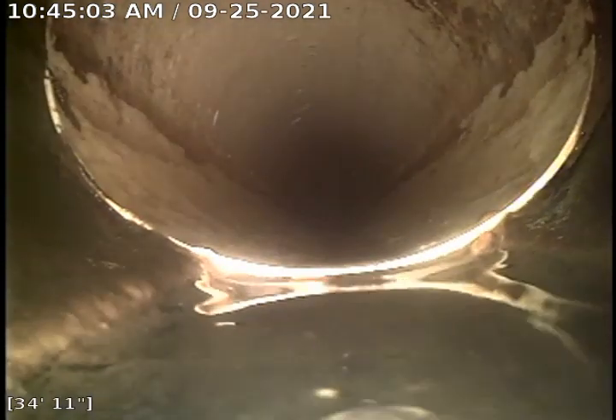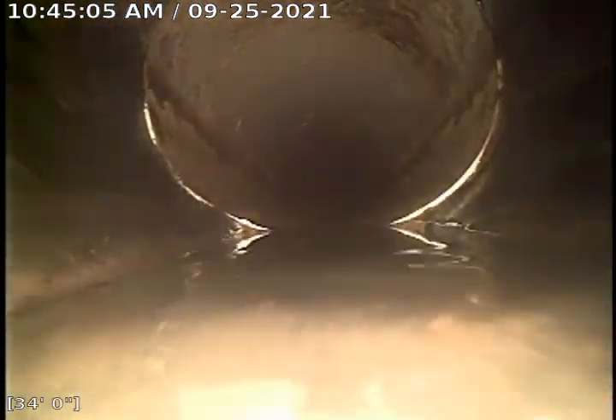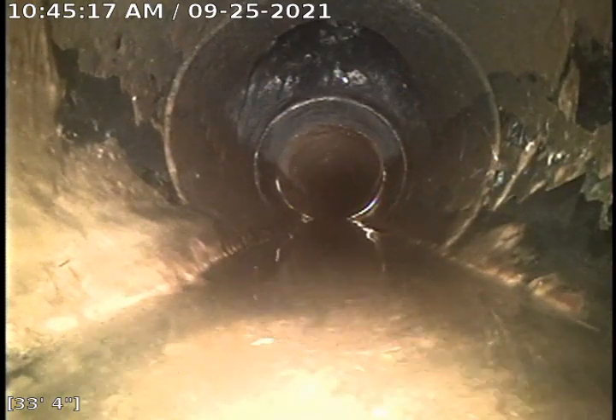I'll notate when I get to where I was at on the first part of the inspection — where the camera was going to go past, which I think was at another video inspection that thought there was a blockage there. No blockage, it was just a hard turn trying to get the camera in there. Right here we'll transition into ABS and we're about 33 feet out.